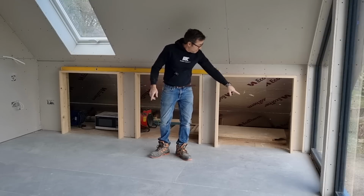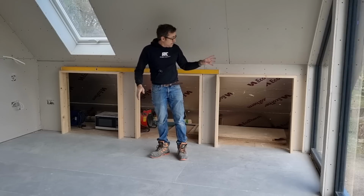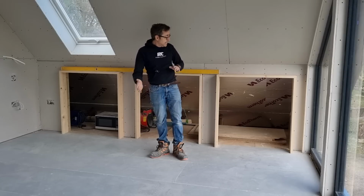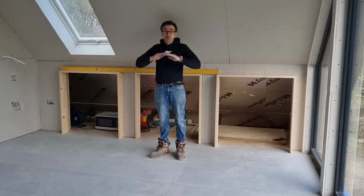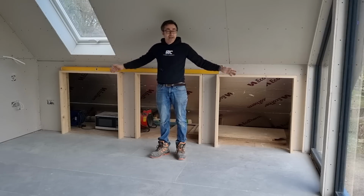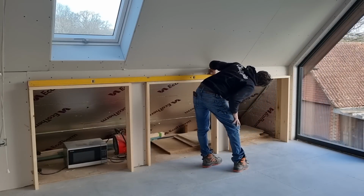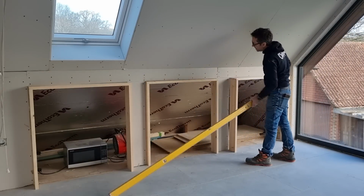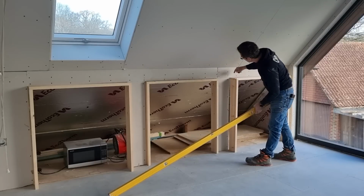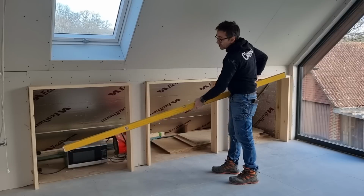First job, make the legs at either end where they're a little bit out the right length. Pilot and countersink them all, stand them all in the openings, fix the outside legs of the far ends, make sure it's all nice and true through the head, and then we'll fix the rest up. So I'm just going to get them roughly in place, and I'm just going to do that by looking through, so I can see that the middle here is nice and parallel to our datum. That's also pretty good there, and the same there. So it's definitely just these outside legs.